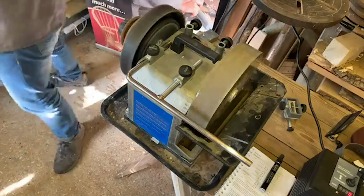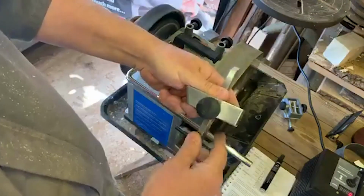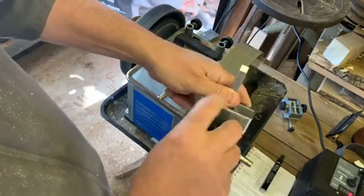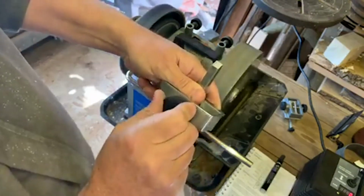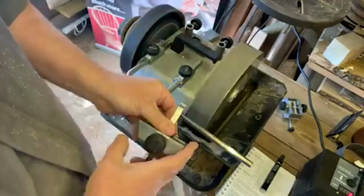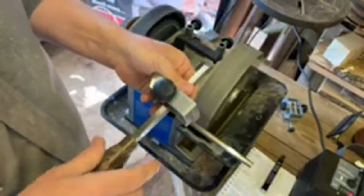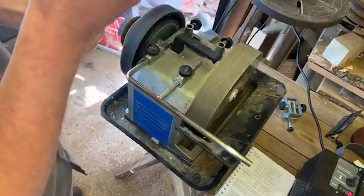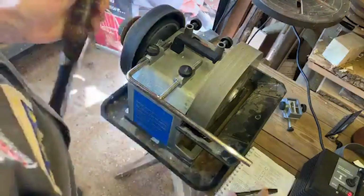Let's do beading and parting tool. That's a nice one. Now all of the other tools, parting tools, beading and parting tools, fit in here in the same way. That little grub screw there, or thumb screw, fits in on top. With these, just make sure that you've got everything up nice and true. Give myself a bit more protrusion there. And I tend to always, with these, just black the back, just to give you a little visual indicator as to where everything is.